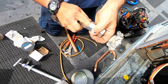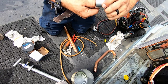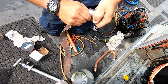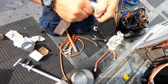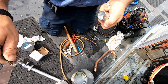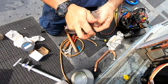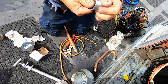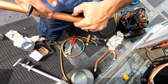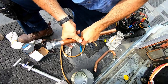It's going to take 45% silver solder to braze dissimilar metals, and flux. We're going to make sure we get it all cleaned up. The metal will heat up faster than the copper usually, so you've just got to watch your patterns and watch your heat - you'll be able to see where it's going.